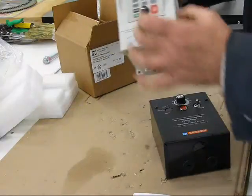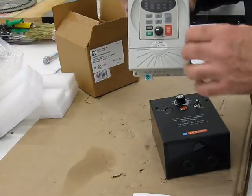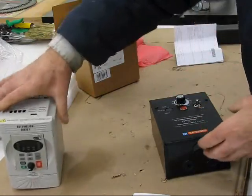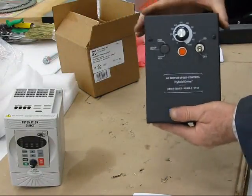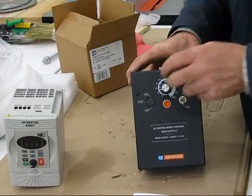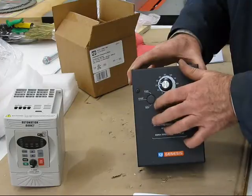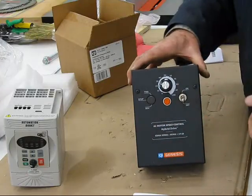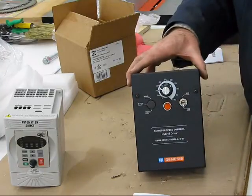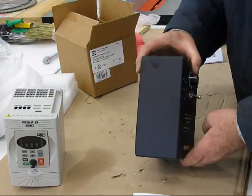This drive is easy to relocate the front, but the front has a bunch of controls I really don't need access to, so I decided not to go with it and ordered this one instead. I'll have it up fairly quickly when I go to modify it — I'm going to relocate the switch, the variable speed control, and it also comes with a forward-stop-reverse switch, which is just a single pole double throw switch. All these controls are going to go on the side of the lathe, as you'll see in a future video.